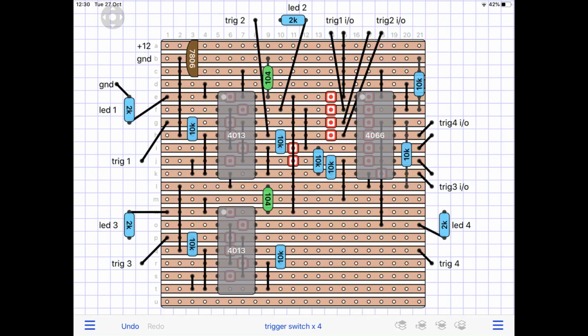Now a lot of these CMOS switches and trigger inputs do have a tolerance on the voltage that they'll operate effectively, and it's usually about 2/3 of the supply voltage. So if we're using a 5-volt regulator with a 5-volt trigger, I didn't want to take any chances for effectively working. So I'm using a 7806. You can get those quite easily, I think. I think you'll get away with a 7805, but you will need your triggers 5 volts or lower.